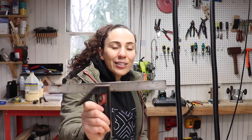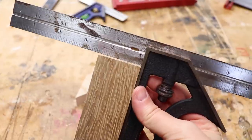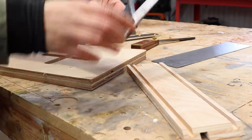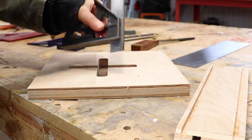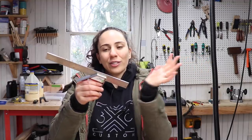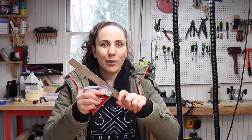So which squares do I like? This Starrett square is my go-to. I always know that this one is going to be accurate and it's always going to tell me if any stock is square or a perfect 45-degree angle. When I lock the wheel, I know that ruler is going to stay in place so I can transfer accurate measurements for things like dados and stock thickness. I also just recently got this square from Capro — it's way less expensive than the Starrett and the ruler holds into place using magnets instead of that locking wheel. I think that's really cool but I wouldn't use this for super accurate projects. I use it just for quick little setups because I'm a little concerned that by knocking it the ruler will come out of place, but I think it's really cool because, well, magnets.